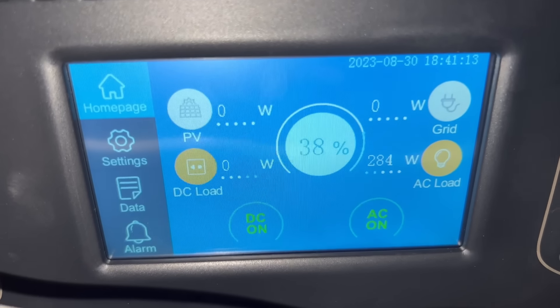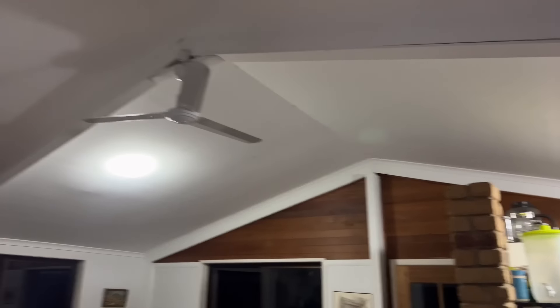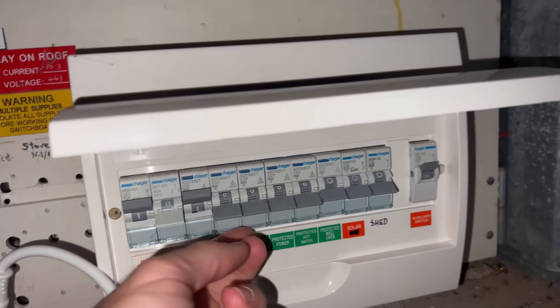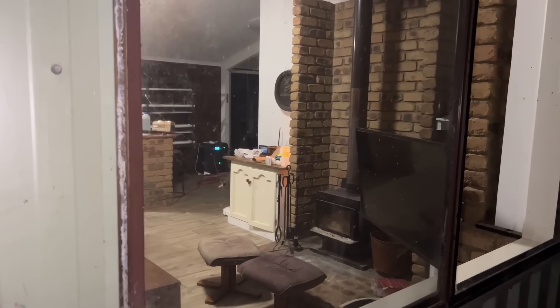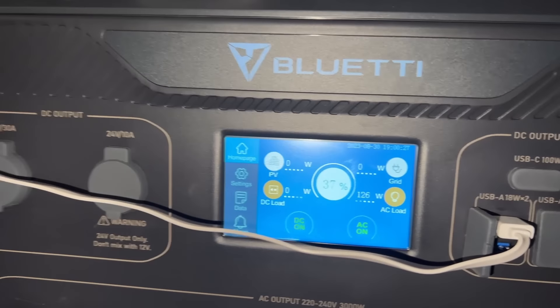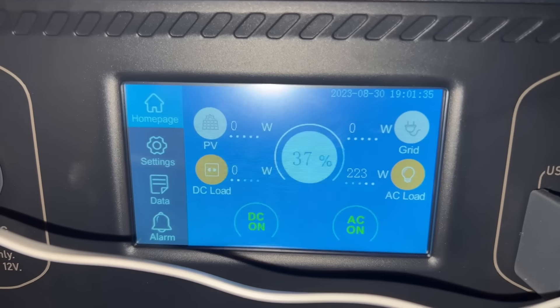Before I turn those lights off, I'll show you what it's drawing — 283 watts. Those neon lights use a lot. LED lights on the inside — I've only got two, they're kind of like oyster lights, and they draw 72 watts. So it's just useful. And lights from the desk: 142, that's only 70 watts. Let's turn that light off. Fixed wireless and router has come on, TV is on standby — 125 watts, that's not too bad. TV's on — 225 watts. That'll do a kilowatt of power every four hours. I can do a few hours of TV.